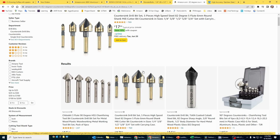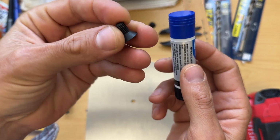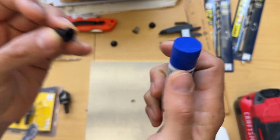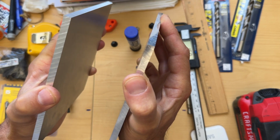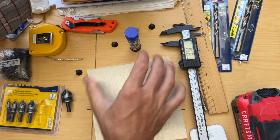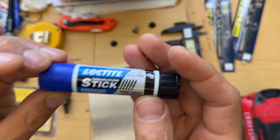screw. And then I suggest that you also buy some kind of thread locker. So you will put some on the threads, and they will stay put, because otherwise when you put together the two plates and the load cell in it, just by moving the plates sometimes you can unscrew the screws, and instead the thread locker will keep them together.